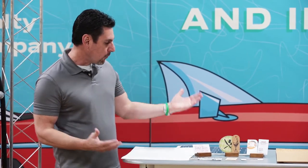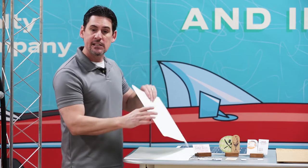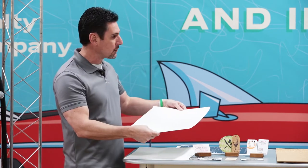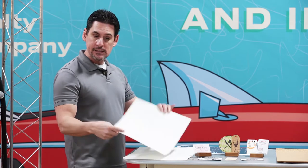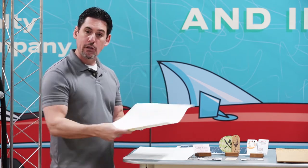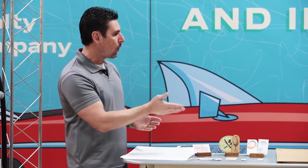Now Laura, as you know, with MultiLoft technology, we coat the backside of all the papers with a glue. It's dry to the touch, it doesn't stick to anything when it goes through your digital printing press. It only seals under pressure. So what that means is you can take multiple sheets of this paper, run it through your digital press platform, print whatever graphic you want on it. After the job is completely printed, you take the sheets, put them together, glue touching glue, activate the glue by pressure with your guillotine trimmer or a platen press, and then you trim out your cards.